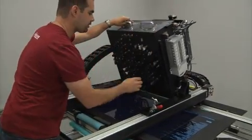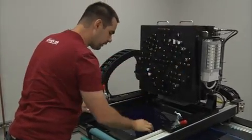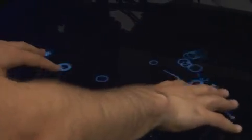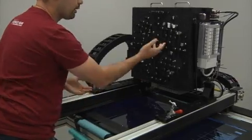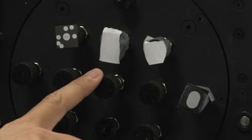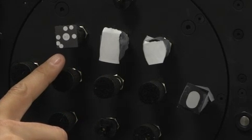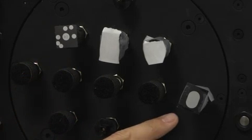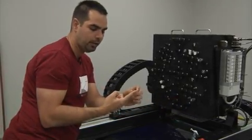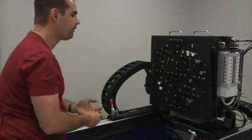is we need something to actually go down and touch the Surface unit. So we've got, we'll call these probes here. And when this is flat down, it presses against here, and we can see the contacts coming down. We've got a couple different types here. We've got what we refer to as a blob. This is just a contact that has no necessary shape or value on it. We've got some here that are tags. This is what you put on the bottom of an object. And then we've got one here that looks like an infrared finger. It's shaped to look like the infrared image of a finger to the surface. So I can put that down and say, okay, did I see a finger go down?